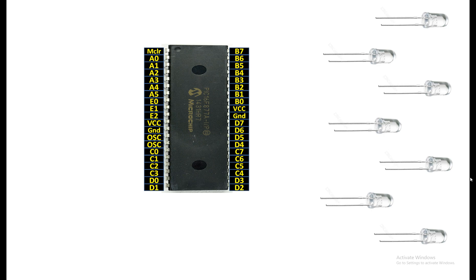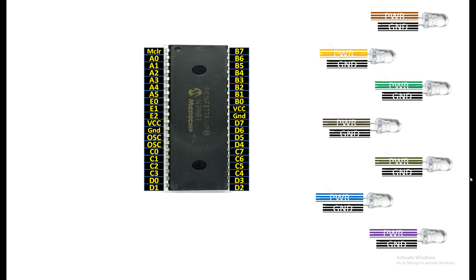As you can see, each LED has two pins — one is longer, one is shorter. The longer pin is always the power pin, the shorter is the ground pin. Remember that an LED is a polar component, you cannot shuffle these two pins. Ground is the shorter pin, power is the longer pin.